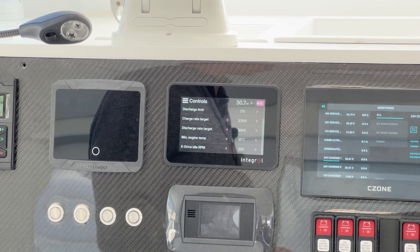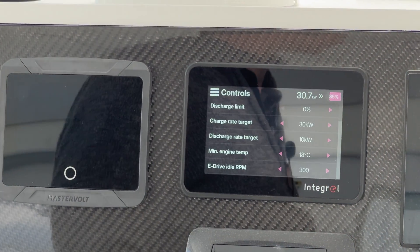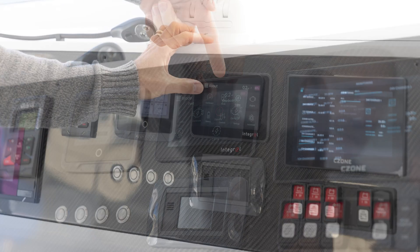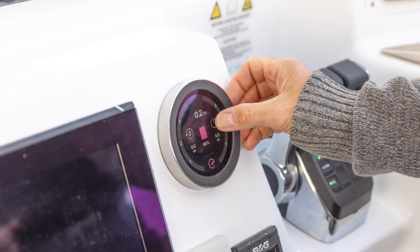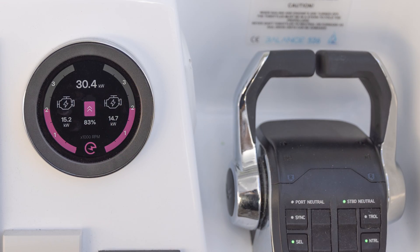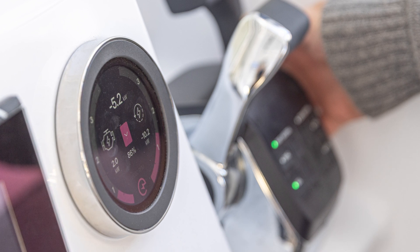Eight batteries for these types has a limit of about 24 to 25 kilowatts, but if you put 10 or 12 batteries in, then they can take this all day long. Thanks for watching. We're excited to keep innovating with Integral Solutions to deliver smarter, more efficient propulsion for our Balance owners. If you'd like to learn more about the VersaDrive or see it in action, feel free to reach out to us — we'd be happy to connect. Stay in balance.